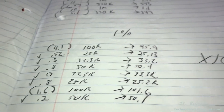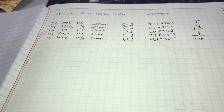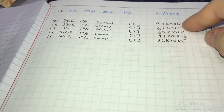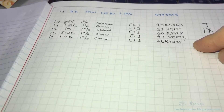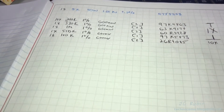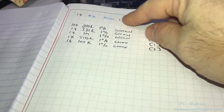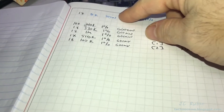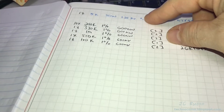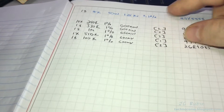You can't improve upon those. So what I did was go to Newark and ordered all of the resistors that I would need in one shot, so I'd be able to replace them as a single project. As soon as they arrived, I'm going to slap them all in. Paying special attention to this one, I decided to get a much larger rated resistor — 5K, 50 watt — that has one of those aluminum mounts that uses paste with heat sinks and screws that will actually mount onto the case.